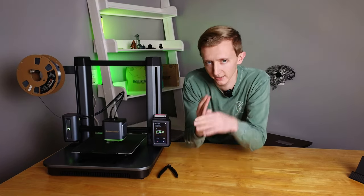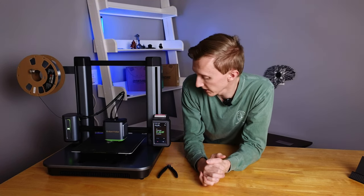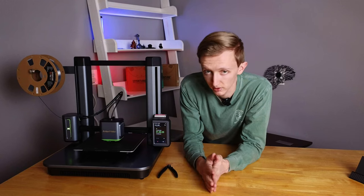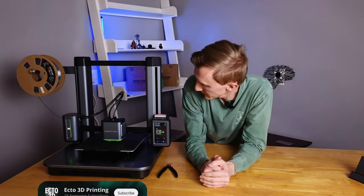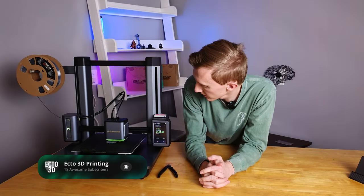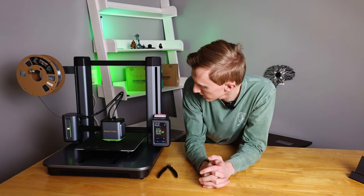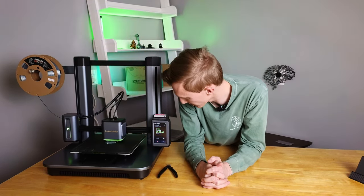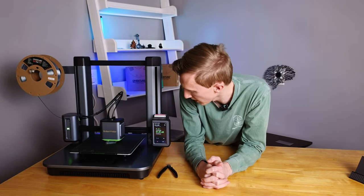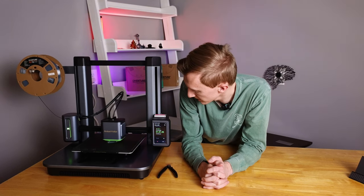I'm pretty sure it does a solid first base layer. I'm pretty sure it's gonna do a zigzag, or opposite directions, on the first two layers. And then we'll see where it gets to for the vase mode action. And I'm ready to hit that stop button if something doesn't look right. Okay, so it's going in circles along the first layer. Is that the first layer? So maybe it did only do, okay, there's the second layer. I was gonna get a little bit concerned if it wasn't gonna do another zigzag layer across.